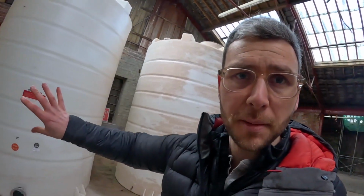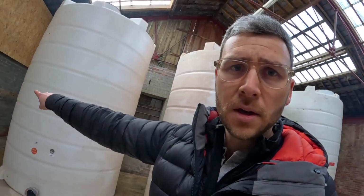They're going to have a pipe going straight through to the back where a tanker can roll up and offload the molasses. Along this wall we're going to be storing our IBCs of evaporated cane juice shipped over directly from Colombia at the moment. So molasses, cane juice, mixing tank, hot water, cold water, dunder tanks, fermenters, wash still, and then hybrid still as either pot or column or from the 3,000 litres into the double retort still.